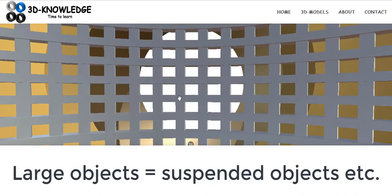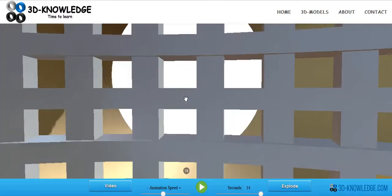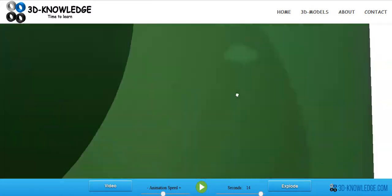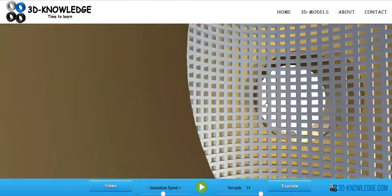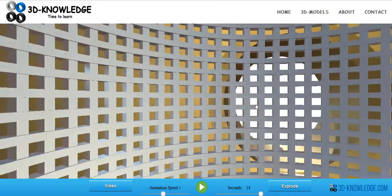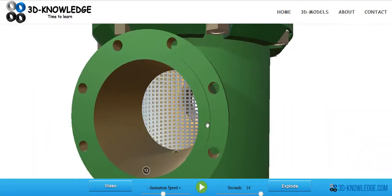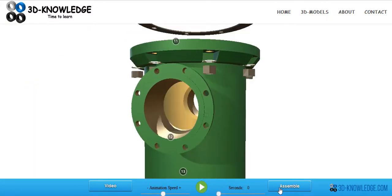The clean fluid with fewer objects will flow out through here. It depends on how big the strainer perforations are — how big these holes are — and that depends on how fine you're going to be filtering the fluid. Normally though, this type of basket strainer will be used for high flow systems. You won't normally use it where you need fine filtering, because the strainer gets quite easily blocked and you end up cleaning it quite often.